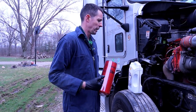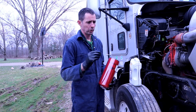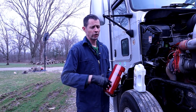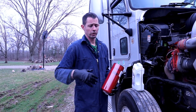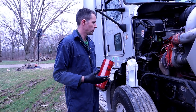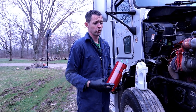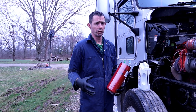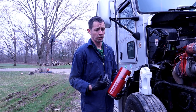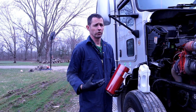If you can't get the filter number, you can cross these filters. If you go to Baldwin's website, you can put in your original Fleet Guard number or whoever's brand you have, and you can cross those numbers. Then take that number and go to Amazon or wherever and buy them a lot cheaper than at the dealer. If you can't make out those numbers, chances are you'll have to go buy your first set at the dealer. Once you get those new filters, take a picture of the filter number - that way later on you can cross them and save about 50%.